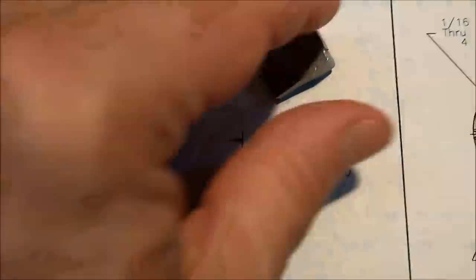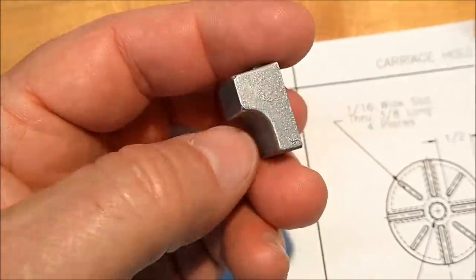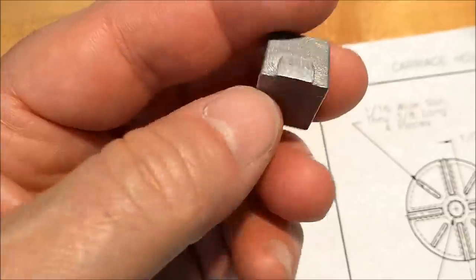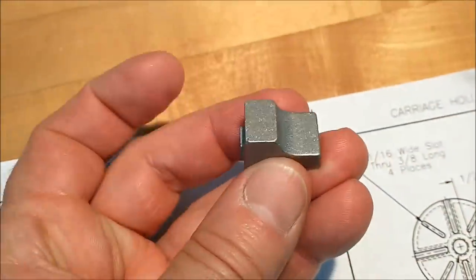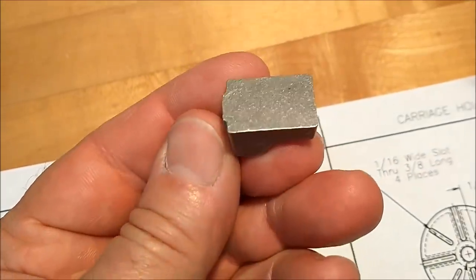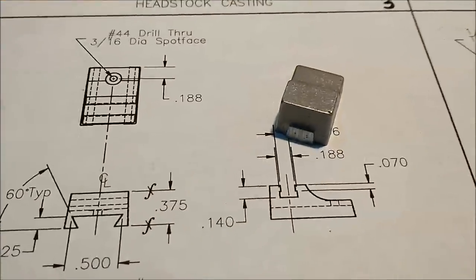All right, let's pop this thing in. I'm going to push it up against the sander, knock the ugly off of it. I'm going to use a file to take some of the high spots off because there are high spots, and then I will delicately squeeze it across the bottom, put the tabs on, or the steps, and then we'll invert it and do all the work from the bottom. Dovetail. Last video. Let's do it.